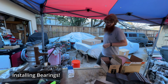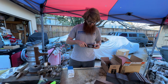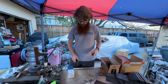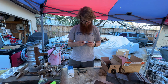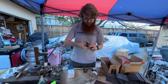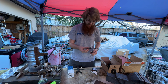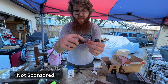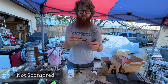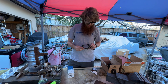While I assemble these bearings, we've got all the rods here for the engine for the turbo and we're going to install all these nice bearings. Just line up the tang with the tang and get them situated. Rock them back and forth a little bit, get them sitting straight in the saddle, line up the tang with the tang. Then when you actually assemble the rod...